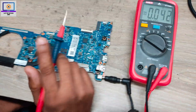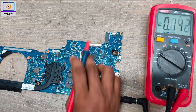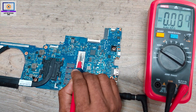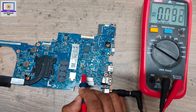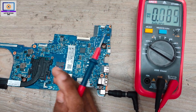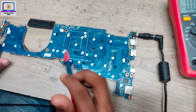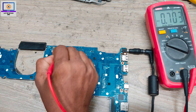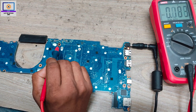Now I need 1V on this motherboard. I don't know exactly where it is. This coil may be 1.5V, this coil may be 2.5V, and this one is RAM supply — 1.2-something. This is for the CPU core. I will flip this motherboard. I found two coils here also. If I check here, I got 0.7V, and if I check here it's nothing.